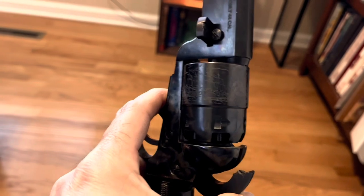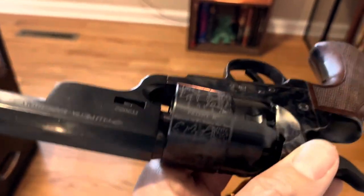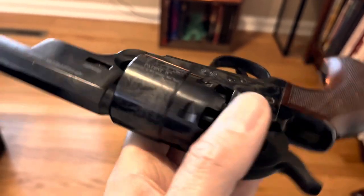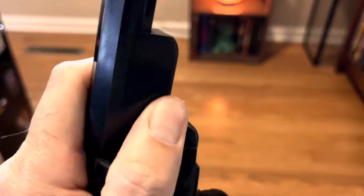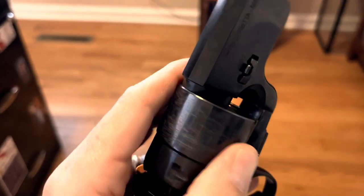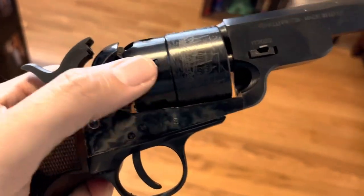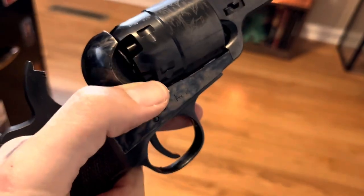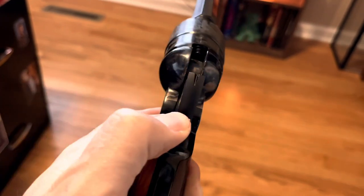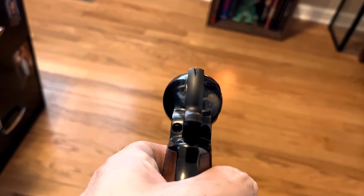You'll notice the engraving on this Avenging Angel — it's the Naval Colt battle scene that you find from the 1851 Navy up to the 1860 Army and 1861 Navy, and that's also on this cylinder. Because it is a .44, you'll notice the step up in the cylinder to accommodate the .44 from the 36 caliber, and the step down in the water table on the frame. This particular one with the factory Pietta cones prefers number 10 caps versus number 11s. You can see the sight picture — that brass front bead shows up pretty well in the notch for the rear sight.